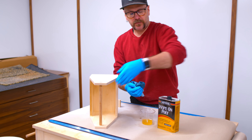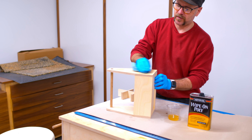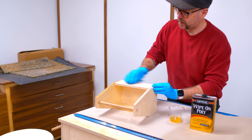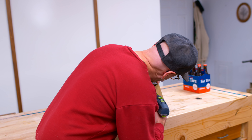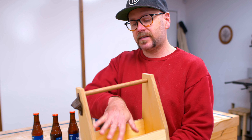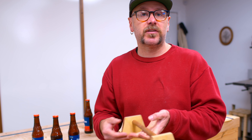The last thing we need to do is put a coat of finish on there — I'm just using the wipe-on Minwax poly. It's really easy to use: you just wipe it on and then you wipe it off. This is probably going to take two or three coats, you need to let it sit a few hours between each coat, but it's pretty flawless. So the last thing we want to do is pre-drill and screw in a little bottle opener on there. There is our little tote. If you're going to put ice in there, I would get a two-part epoxy and coat the inside — that's going to make it waterproof, so as the ice melts it's not going to leak through or seep into the wood.